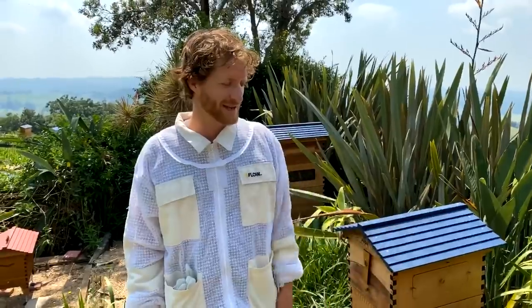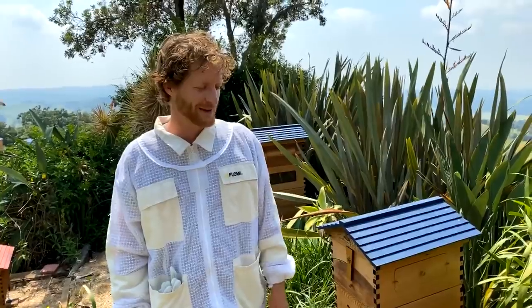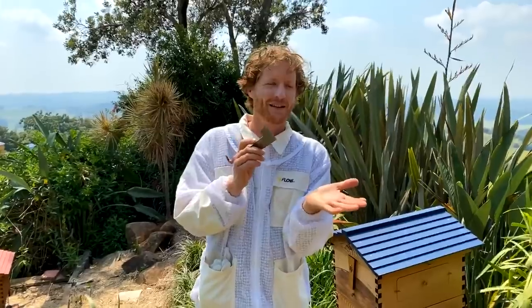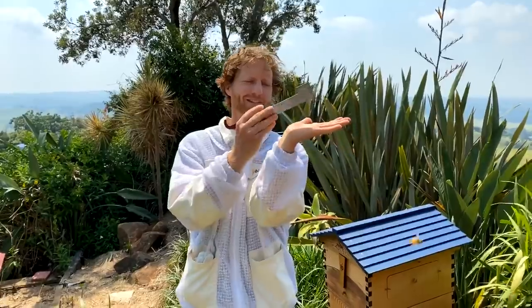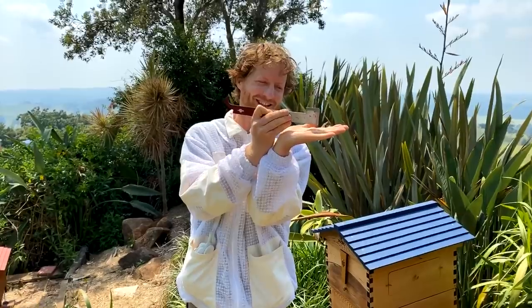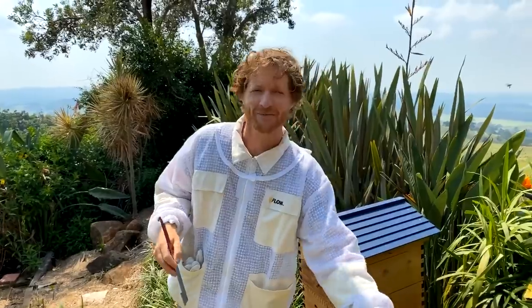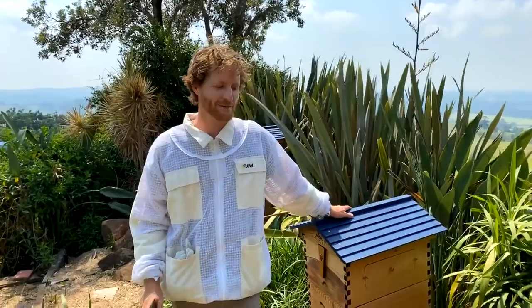And as to cutting windows, you can certainly cut windows with a jigsaw. It's a little bit tricky, but if you don't want to drill a hole to start your jigsaw, then you can do what's called a plunge cut, where you get your jigsaw, and there's your piece of wood, and you get it going at high speed and you just let it dig in as you move it down. That way you don't have that hole on the edge of your window. But if you're not used to doing that kind of thing, you might want a little bit of help there. Nice idea, the plunge cut, I like that.